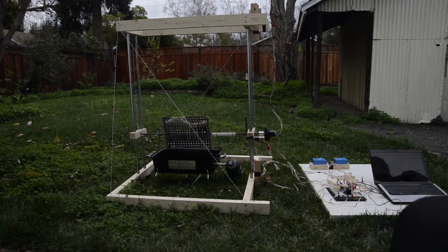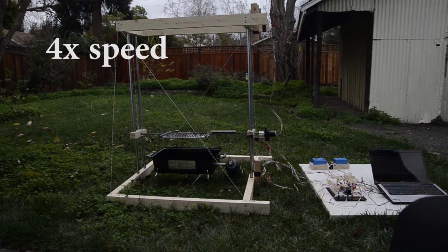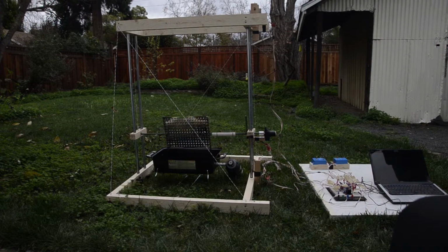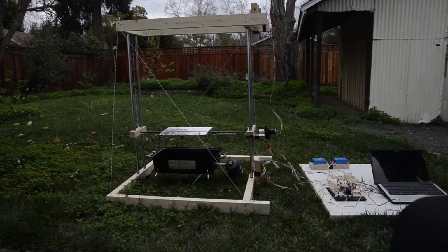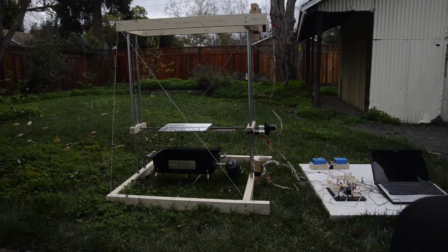After 1 minute is reached, the barbecue turns the grate automatically and burns the other side. Also for 1 minute. After 1 minute is reached, the barbecue turns back the grate, so the temperature sensor is on the lower side again, and drives up, so the temperature lowers a little bit and the meat can broil the rest of the time in a lower temperature.